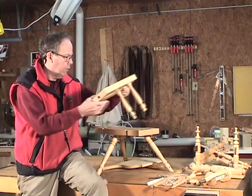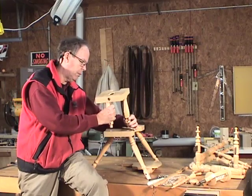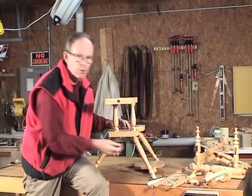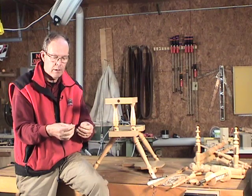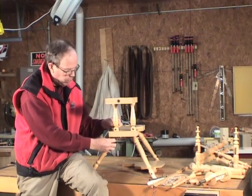Then we're going to go from that rear leg to this part, which is the table that the mother of all sits into, and we place it right here on the end of the bench, and we're going to use one of these combinations of barrel nuts and bolts and a couple of washers. If you've got 4 of these and 2 of them are shorter, the shorter ones go up in here.